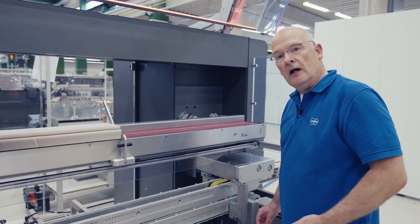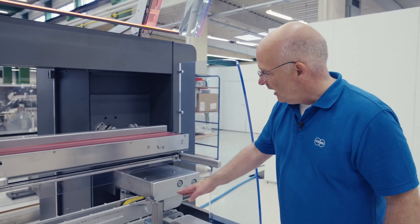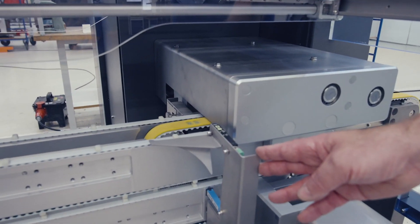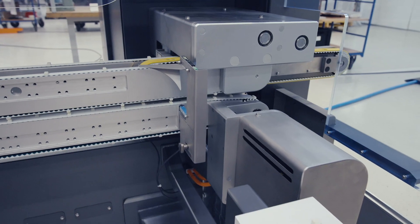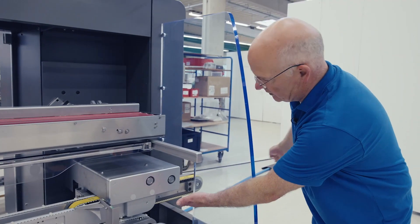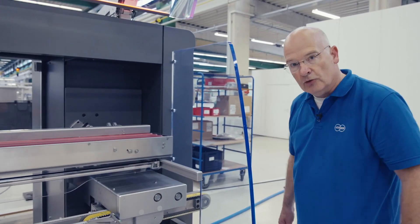This could be a carton closer with hot melt or printing with print inspection by camera. The last control system is a sensor to detect an open flap. By a light barrier, we can detect the closing elements of the carton and decide that the closure has taken place successfully. Only good cartons are placed to the downstream equipment; bad cartons are released into a reject bin.